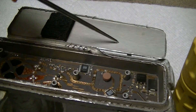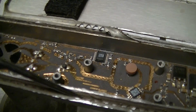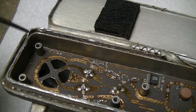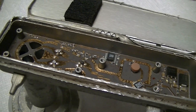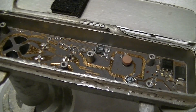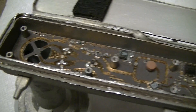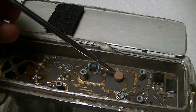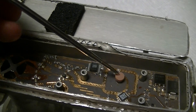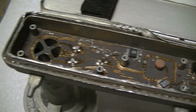This one had a sealed can, which was sealed in some kind of potting — although fortunately there wasn't any potting in here, which obviously you wouldn't want, because that would really cause problems with the RF signal properties of this thing. Especially since the shielding can wasn't liquid tight. And one more thing: on the shielding can there was a tuning screw right over this little pink thing — that's just for tuning the DRO. That's just another random trinket.